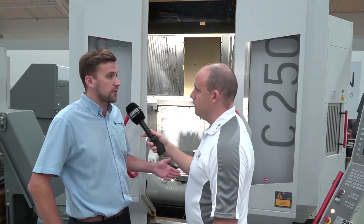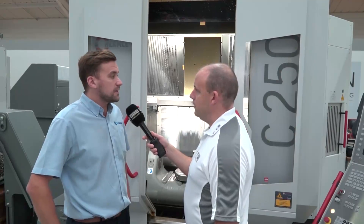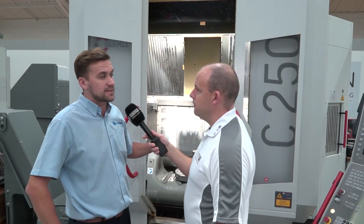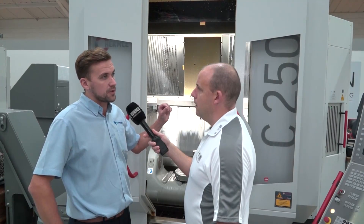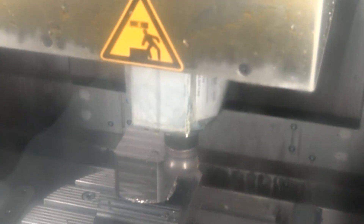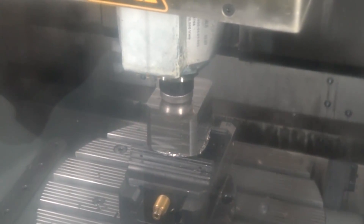On the performance line spindle, there are two options: as standard it comes with a 15,000 RPM HSK 63, but you can also get an 18,000 RPM HSK 63. These are two-piece spindles — in between them you have crush bushes, so if you have a Z-axis collision the crush bushes take the brunt of the collision and save the spindle itself. That's quite unique to Hermle's design — on the Z-axis if you have an incident it acts as a cushioning impact. These are sacrificial aluminium bushes which trigger an e-stop before any damage is done.